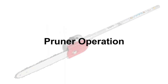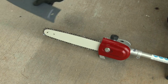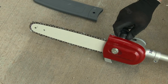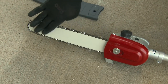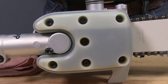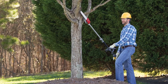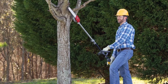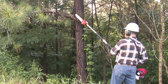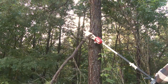Once the attachment is securely installed, it's recommended to inspect the pruner and power head for possible safety concerns, like loose parts or damaged safety guards. Never operate the pruner without the safety guards installed. Also, be sure the chain oil reservoir is full and the chain oil is lubricating the guide bar. Always hold the pole pruner to your right side with both hands to prevent contact with the hot muffler. It's recommended to increase the throttle to full speed for maximum cutting efficiency and allow the engine to idle when not cutting.